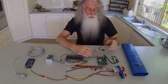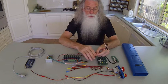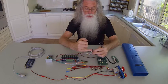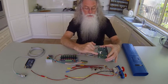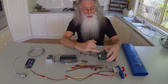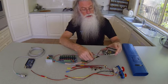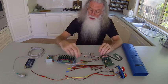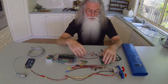Now the wiring is such that they are a DuPont 3P or 3-pin plug, but I only use the two outer sections to carry the wires. For the adapter I showed you before, you use an inline row of pins, take the center one out and solder it in. So I've soldered that to the back of the push button, color coded it. As you know, I love to color code, so the color code's on the actual back of the switch, the same color code that's on the wiring. So they just clip on the back of there, and that completes that part of the circuit.